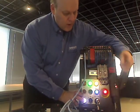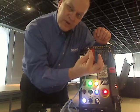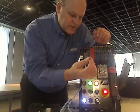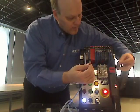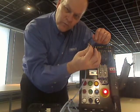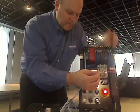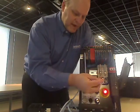So I can open the door. And as an extra precaution, I can take the key with me from my trap key switch. This would mean that if somebody came along and tried to lock the door, the machine wouldn't run until this key is put back in. So if I'm not done my maintenance, it won't let it start back up.